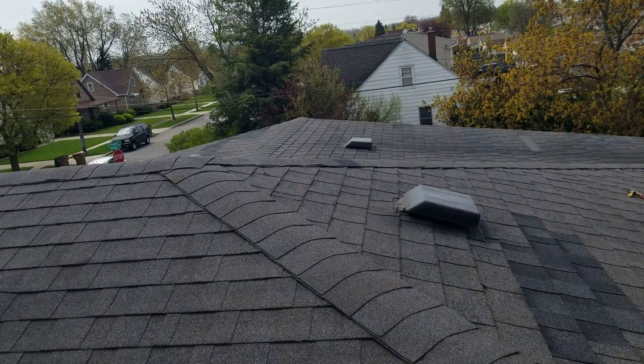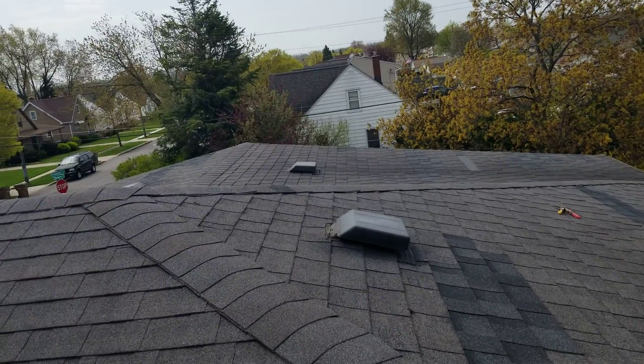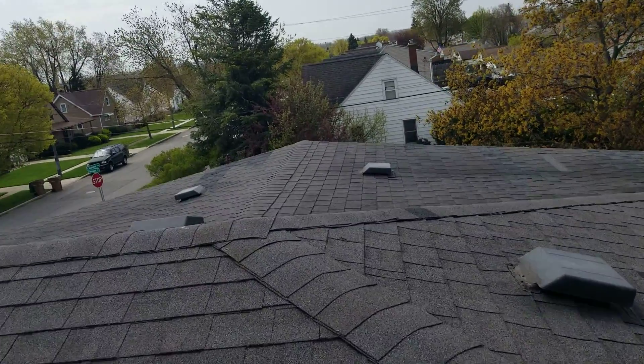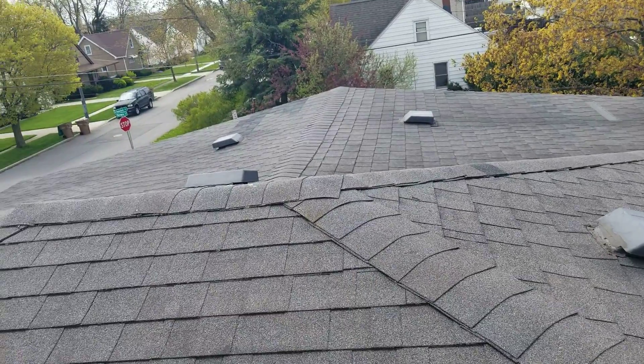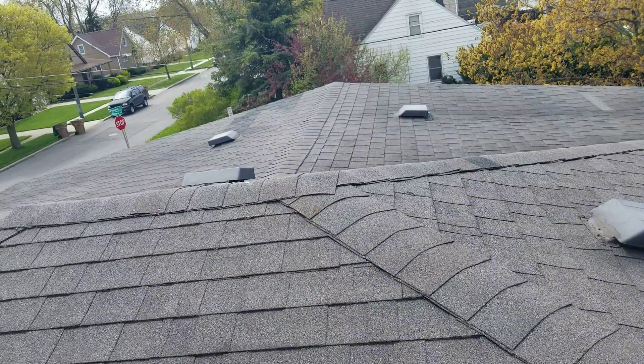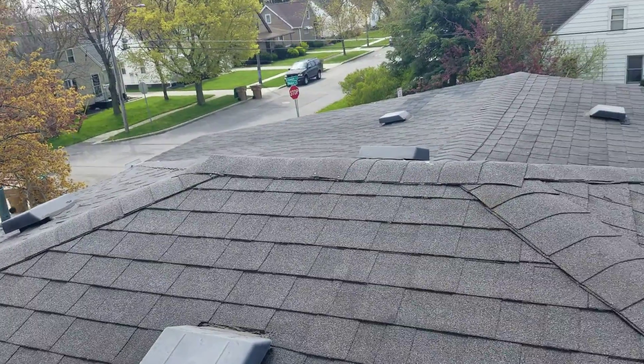This is nothing but a big old snow load carrier. The roof vents are useless because there's no real heat loss in there, so there will be no roof vents on this section. It's got a bit of a concaveness in the middle — I'm concerned that the rafter or the ridge board may have taken on some stress. We won't know that until we tear it off.